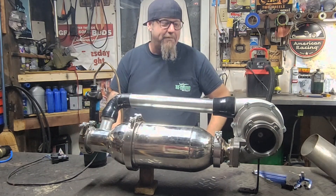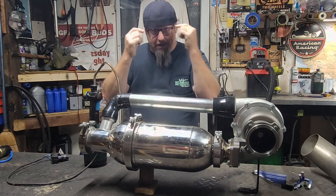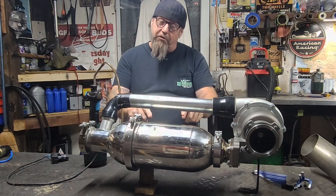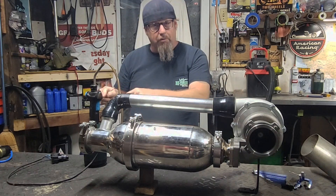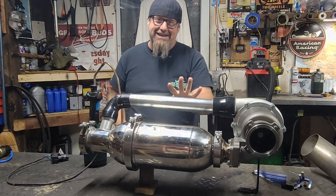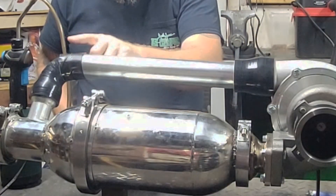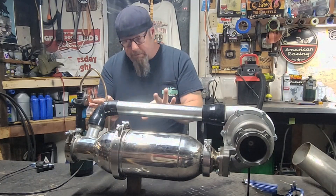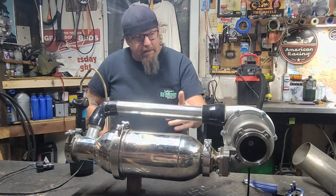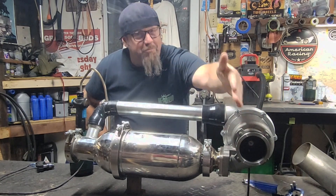The longer I hold that button, the more it sparks. Now that this is hooked up, this is really the time when you just got to put your rocket science glasses on and start to really think about everything, because we are about to fill this combustion liner full of fuel and put a spark at it, and possibly blow a bunch of boost at it. We can't yet — this is still a bit mocked up, this isn't the proper coupler. I'm waiting on another coupler, I still need to do a couple details up here. I don't want to put full fuel to it yet. I don't have an oiling system yet. I don't have anywhere for the thrust to go yet. So I really just want to be able to test this.